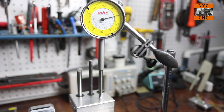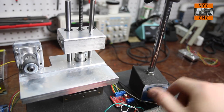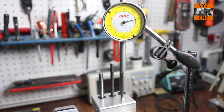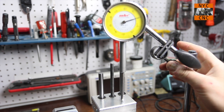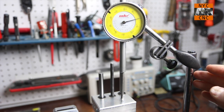For non-machinists folks out there, the indicator we're using is called a dial indicator. This one is relatively inexpensive - if you're interested in making precision measurements like this, you can purchase these from a company like ENCO or even off eBay with a magnetic base holder on a granite surface block. You can rotate it to move around and then lock it back in place. We're just a tick past zero - rather than rotate the bezel, you can twist this screw to get right on zero.